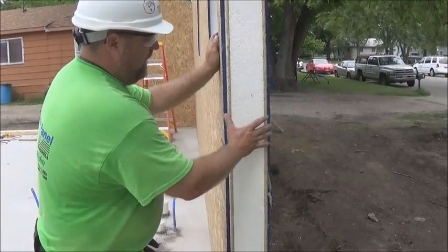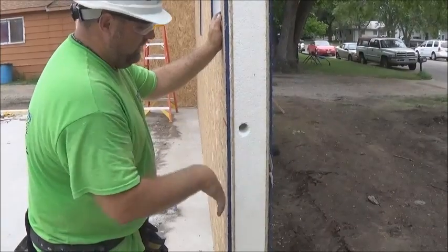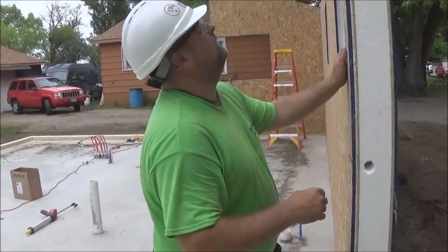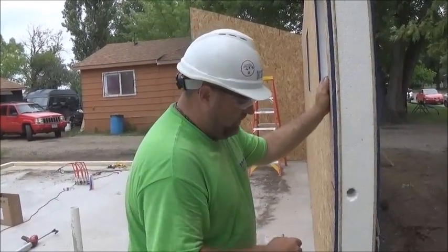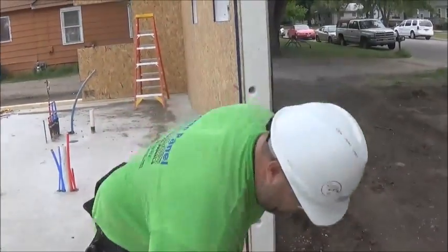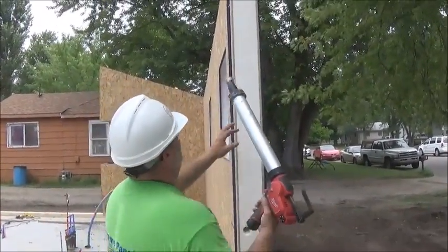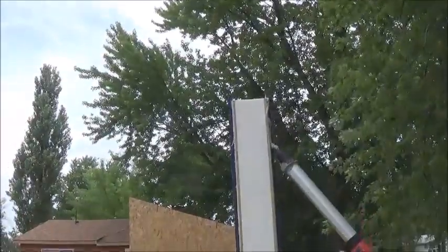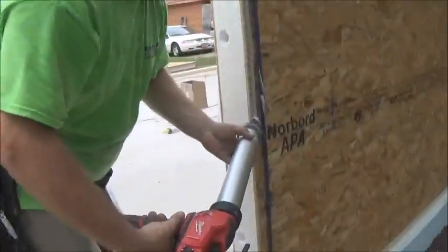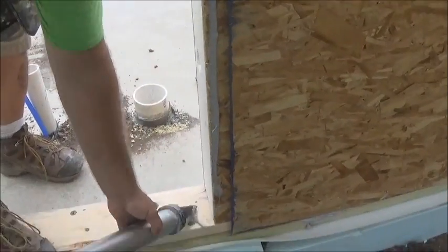Having these edges routered will compress the edge, but in high humidity and a lot of moisture you'll find that you'll be pushing these in a little more. Now I'm going to glue down the spline again — we don't really need to fasten it yet; we're simply going to put it in there and let the glue do its trick. Another trick is to put the glue on the edge as close to the edge as you can — it'll just provide a little lubrication.